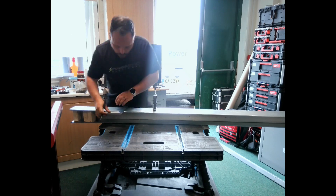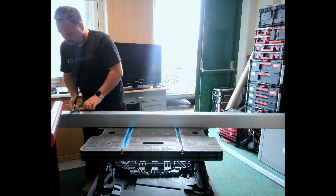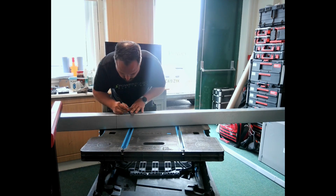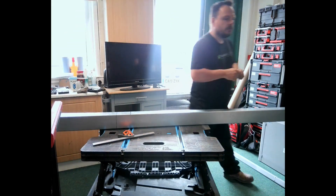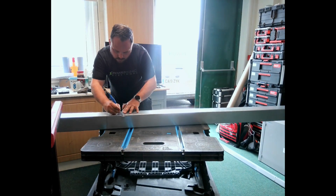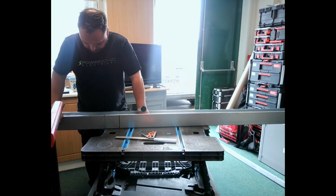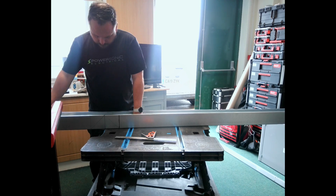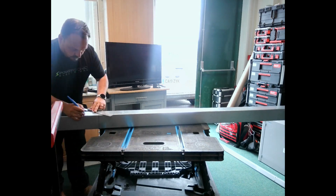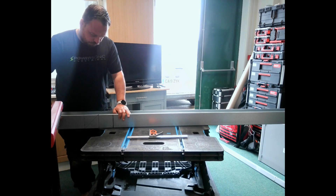You can see me just trying to secure it so we get a nice solid lock while doing these marks. You need a set square - if you haven't got one, you're going to need to get one. Then it's a case of marking a center line. It can be a bit of a mind-bend if you're not used to doing metalwork. I don't do a lot of this by choice - we usually buy our pre-fabbed ends and corners, it's just not cost effective. But we thought we'd do this just to see if that was true at today's money.